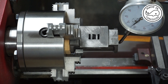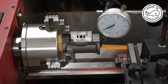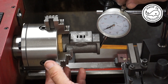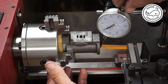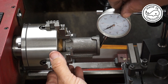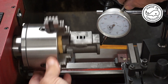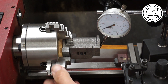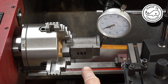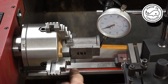Having got it nice and parallel, I then put the gauge on and make final adjustments. I'm putting the gauge on the inside of the cylinder. I made some minor adjustments and we're pretty close now — this is measuring the inside of the bore, bearing in mind it's not been machined. Close on zero at 0 degrees, close on zero at 180 degrees, and just slightly over zero at 90 degrees. I'm really happy that's pretty close, and I also checked again to make sure these edges are parallel with the bed.